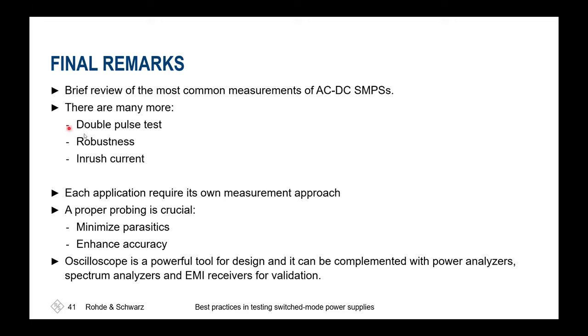And then you could also do an estimate already inside these test systems on the losses effectively and also the system behavior. In general, the parasitics are causing us the most headaches, and the higher the frequencies get, the more harmful are these parasitic effects. And that's also something we'll take care of in the presentation of next week, how our measurement system is affected by these high frequency components, and also how to get a good accuracy or at least a reproducible measurement out of our setup.